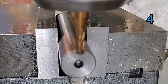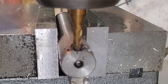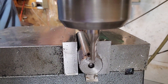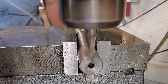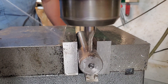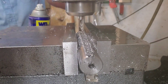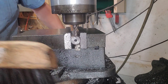Now, you remember how I told you I was incredibly cheap — I'm wondering how long this end mill is going to last. Well, I think you already figured out what's going to happen. Shame on me, I should have known better. I'm going to grab a brand new one out of the drawer and do this right this time. Using the paper trick again to find my height, and we're off to the races. I'm going to take most of the bulk off on the first pass and then come back and do my finishing passes. Normally I should have flood coolant on this to wash the chips away, but today for your benefit I'm going to use WD-40 — I have decent ventilation in the shop so it'll keep things a little cleaner so you can see what's going on.